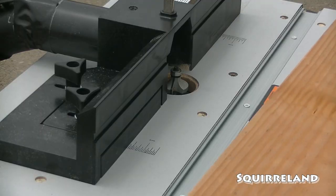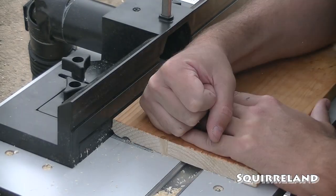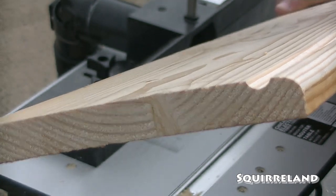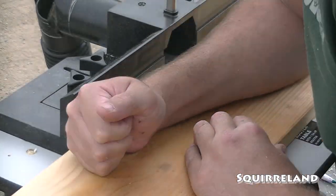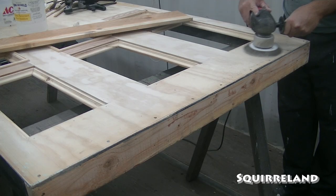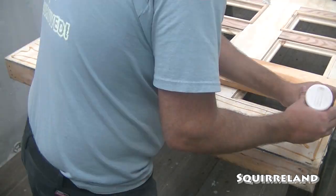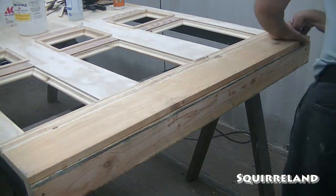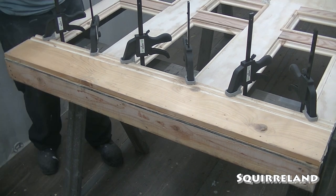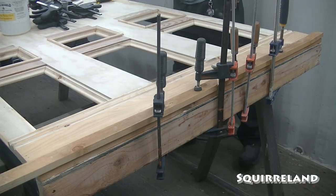Next up, I'm going to work on the baseboard. When coming up with this design, I had to make sure that I didn't add any more than three quarters of an inch to the front face of the panel, which is how thick one of these pine boards are. The reason for this is that I need to be able to stack them as efficiently as possible when they go into storage on the off season. That means I had to design a baseboard that looks good but doesn't stick out off of the panel any further than that three quarter inch limit. With the design cut into the board, I glue it to the panel and use a combination of finishing nails and lots of clamps to get the board to lay flat.